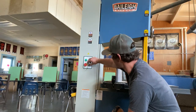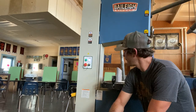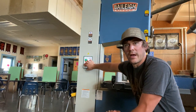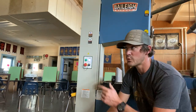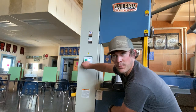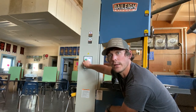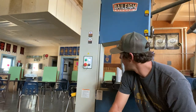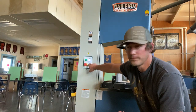To turn on the bandsaw, there is a switch that powers the machine — you'll see a white light confirming power. Also double-check that the red button is popped out. Much like the drill press, the red button is our stop or off switch. When pushed in, it is locked and the machine will not turn on no matter how many times you press the green button. Push the red button to pop it back out and unlock it.